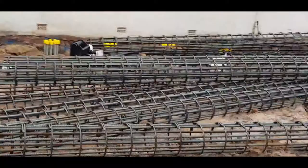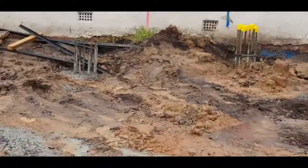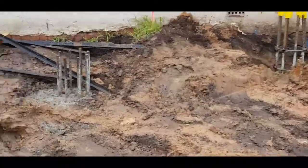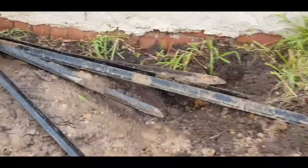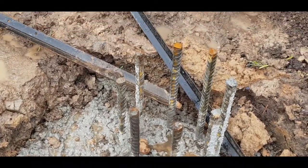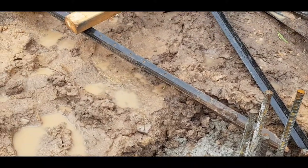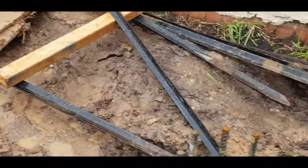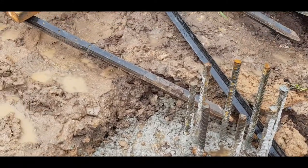Here you can see the cages on the ground, and over here you can see the finished product where the cages have been filled with concrete. These steel rods sticking out will form what they call a cap beam, going in early next week and filled with concrete, tying all these together to hold the concrete floor which will become the roof of the basement and the floor of the ground floor.